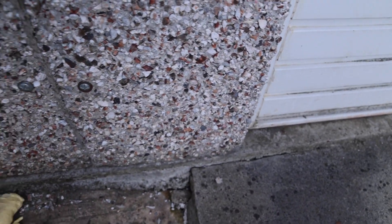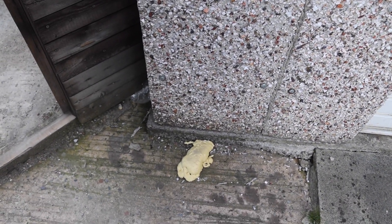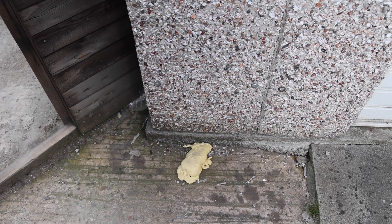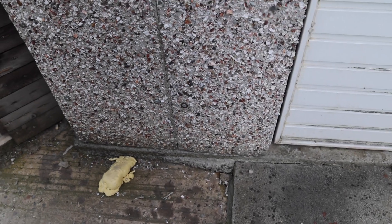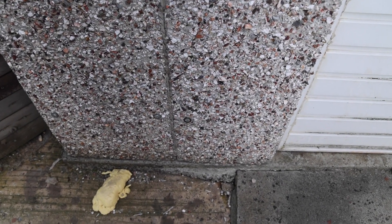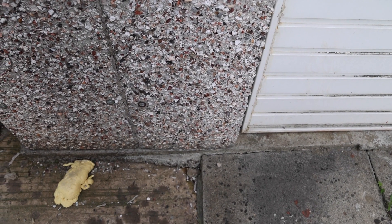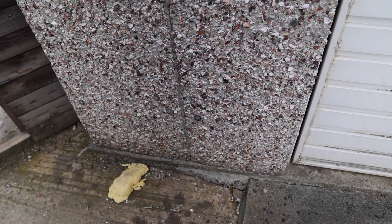That's why I'm having to put a border of cement around, just to try and prevent the weather getting in. It's really important that you make sure you have a decent amount of border protection on the inside to prevent rain getting in through the bottom of the slabs. Unfortunately they're not completely flat — there will be micro-cracks where water can get in, and trust me, water will get in no matter what. So if you want to seal it up properly, do a good job around the door, because that's where your weak points are.